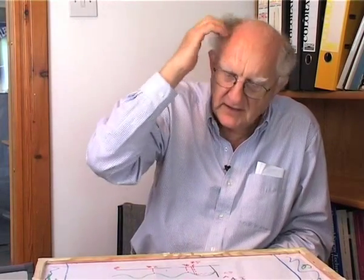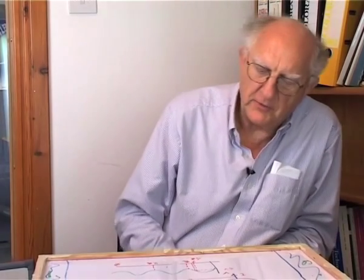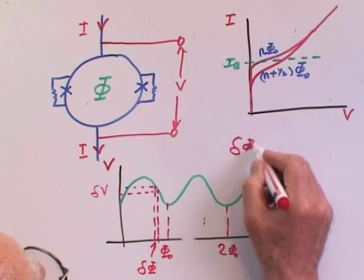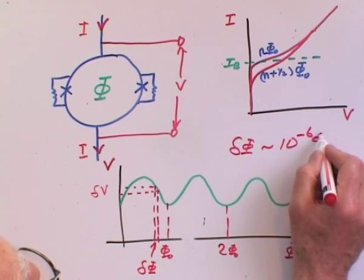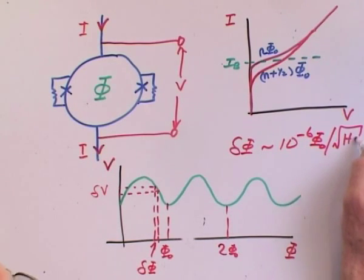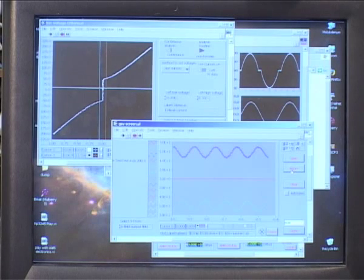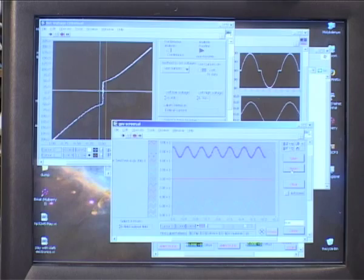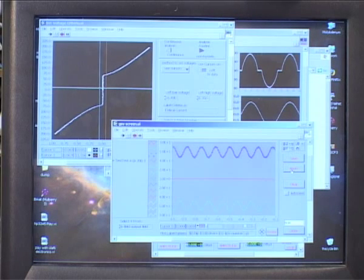This effect is closely analogous to Young's slits in optics, and that is in fact the origin of the acronym: Superconducting Quantum Interference Device — quantum because of its quantum behavior and the flux quantum, interference as in the optics case. Applying a small magnetic field to modulate the critical current gives a nice, very periodic sine wave, exactly equivalent to a Young's double-slit experiment with two narrow slits that are quite widely spaced.